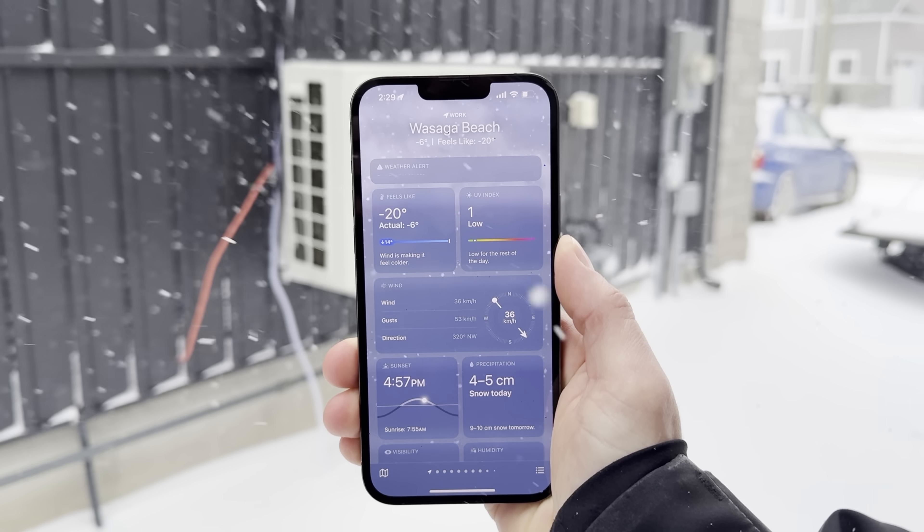The other thing I don't like is that this unit is rated to work down to negative 15 degrees. For the last week or so we've had negative 12 to negative 10 degrees but with a heavy wind load, so it feels like negative 20. In that temperature range, even at negative 12 with no wind feels like negative 20, it doesn't really heat. It will maintain, but if we turn it off for the weekend and come in Monday with it at negative 10 outside, the garage doesn't get hot — it just blows a gently warm breath into the garage. We have a big heater we have to turn on first, and then the mini split will maintain. Anything below about minus five, it just doesn't seem to really heat.